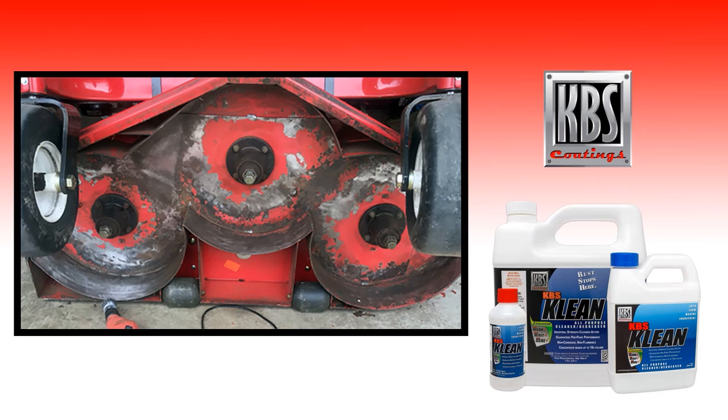Next, scrub the underside of the mower deck with KBS Clean, which provides a clean surface for application of Rust Blast. KBS Clean is a powerful cleaner that deeply penetrates and removes stubborn soil from most surfaces without leaving harmful residues or emitting noxious fumes. It is a concentrated, water-based, biodegradable formula that's an excellent alternative to flammable solvents and hazardous chemicals. KBS Clean is designed to be diluted with water — a full-strength dilution is one part water with one part KBS Clean. Apply to the surface liberally using a bottle and pump type sprayer or garden type sprayer and wash for five to ten minutes.